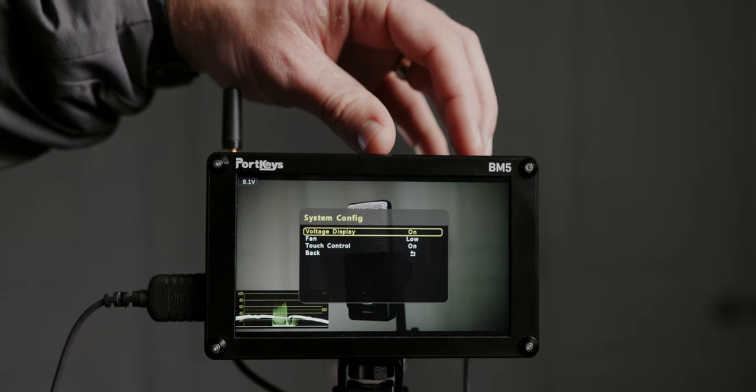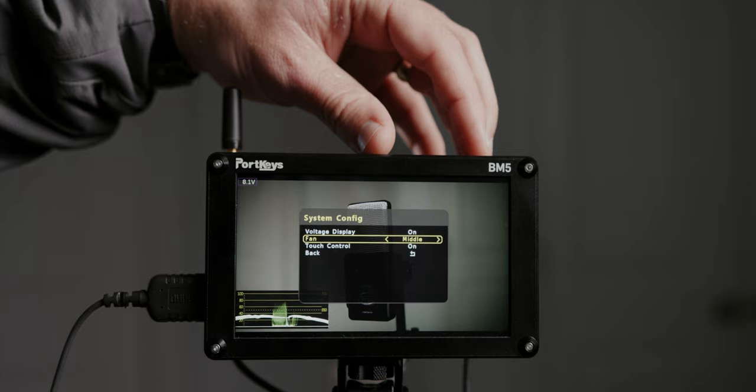Obviously the next thing I really like is how bright this monitor is — that's kind of the biggest selling point in my opinion, apart from the camera control. You don't need a sun hood or anything; it's just that bright in daylight. With the high brightness setting you can change the fan speed, which is nice. At full brightness you want the fan on high to keep things cool, though it is audible outdoors. You can tame it down to low when the backlight is set low, like when shooting indoors.